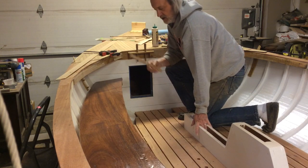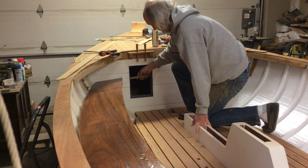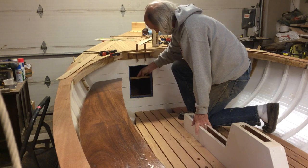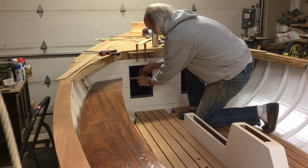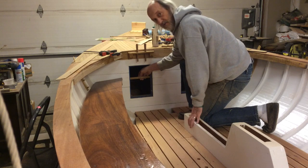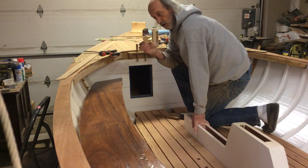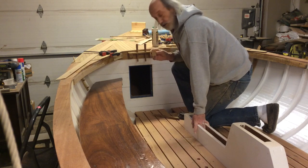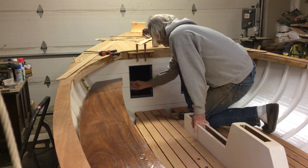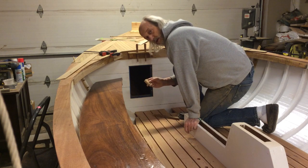I want these to be able to fit inside the hatch like this. We'll put the bolt all the way through from the front side with the knob on the front, be able to twist it. But in order to keep this thing from spinning around on the inside, I've got to put some little blocks in there. I've cut out some oak blocks. For the time being, I'm just going to try to glue them in there and see if they'll stay — I've got this Titebond glue. If that doesn't work, I can drill them and run a little screw in there to hold them.